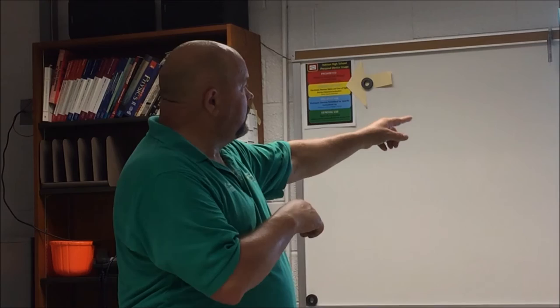As I say, based on my firsthand experience in the field, using my own HT, seeing how a tiger tail helps it, because I have played around where I'm doing ARES drills with and without, I've seen that it appears to work better. We've heard Mary's story about how it helped her. I've looked at how it changes the SWR, and I've looked at how it changes what I would call the apparent output of the HT, and everything indicates that if you've got an HT and you really want it to be reliable or more usable, spend the 20 cents. Most likely you spent a couple hundred bucks on the radio, so the 20 cents is worth it. With the aftermarket antennas, the 20 cents is even more bang for your buck. It's just not that much.